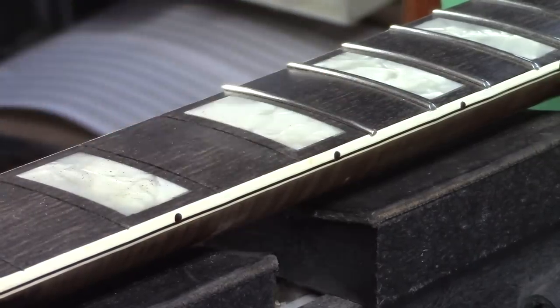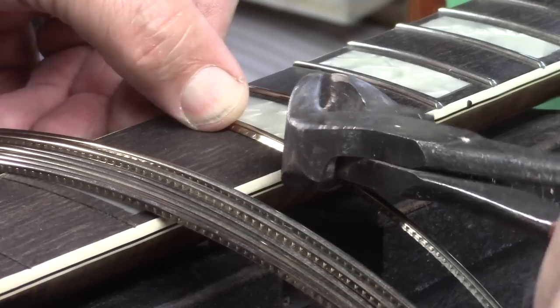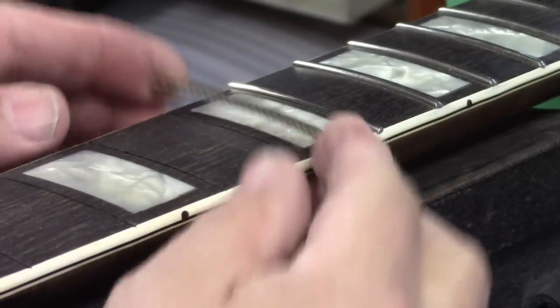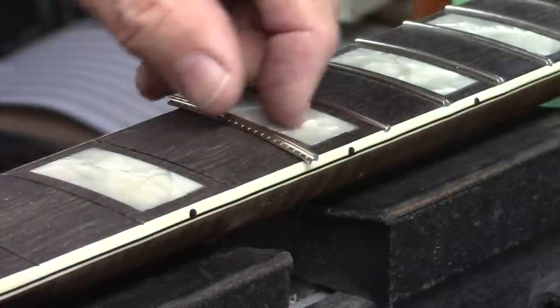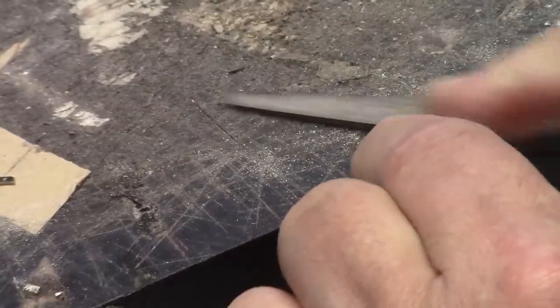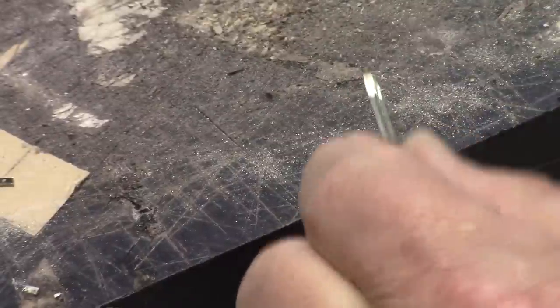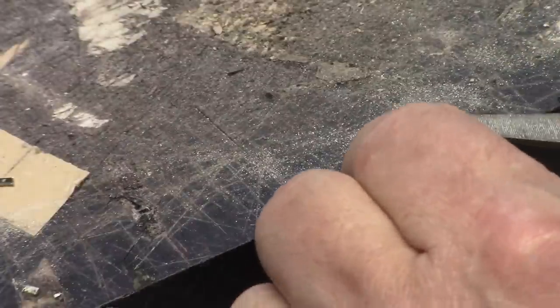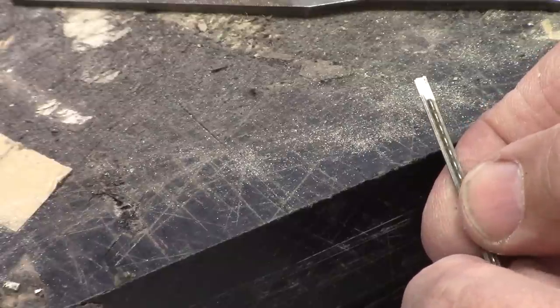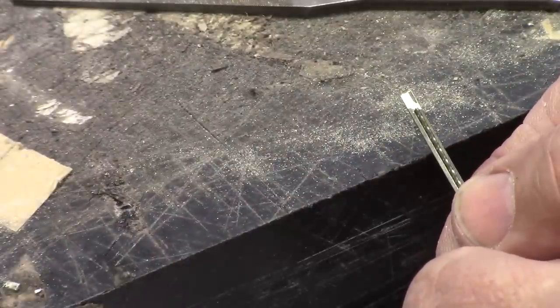That's good. It's in nice and tight. Okay, so first step is to cut that fret just a little too long. So these are the tolerances we're talking here. That's our next tolerance. Next, we're going to nip off the tang on either side. Okay, here's our next step. Going to nip off that tang on the underside. Next step, going to clean off the remains of that extrusion on the underside of the crown so it is flush. Other side, same thing. There's the side view. So we've cleaned off the remainder of that extrusion of the tang on the underside so it's dead flush.